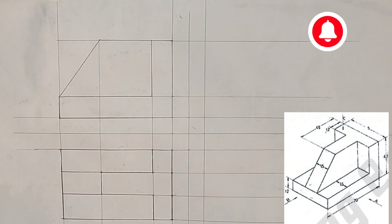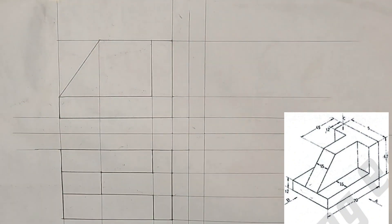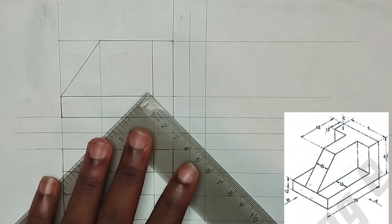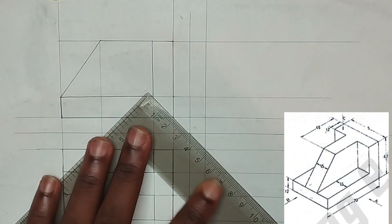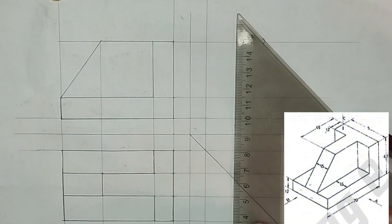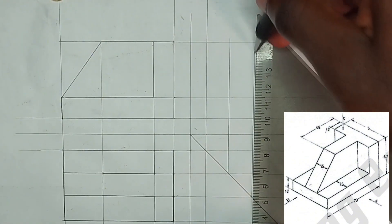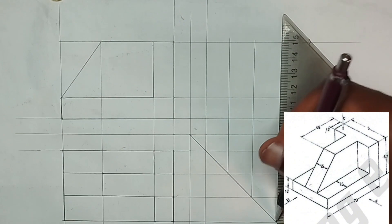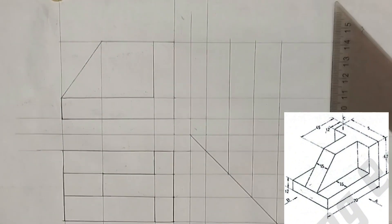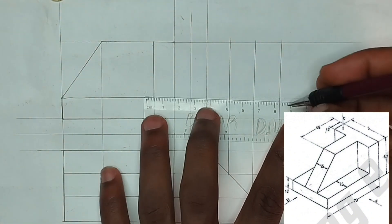Now we are taking out the plan or top view, and we are going to be drawing our side view or side elevation. From this center — the center of this line — we are going to be picking 45 degrees and drawing the 45-degree line sideways like this. From each point that this line is touching we are going to be projecting upward — projecting this upward, and this upward, and this upward also. Now we are picking our points out from the side elevation; all the points have been chosen so we are just taking each of them out.